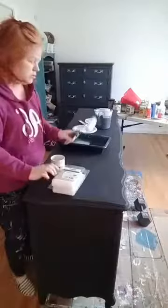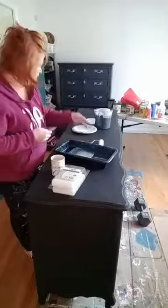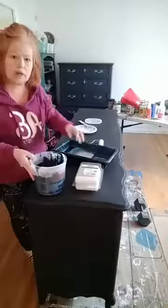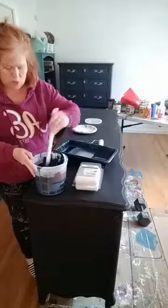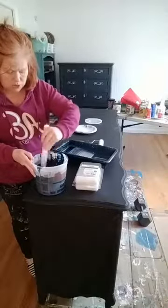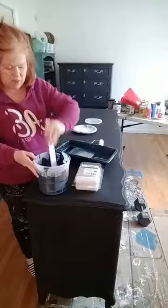Now these are some of my favorite, can you see that? Some of my favorite rollers, they're foam. Because this is a long piece, I am going to roll it. When you have big surfaces, if you can roll it, it's way faster to roll. And also that way you don't see all the brush marks that tend to happen.